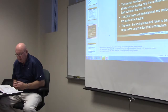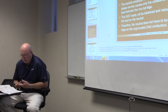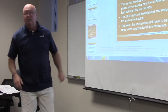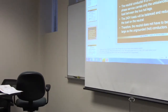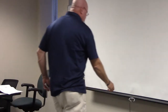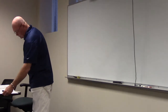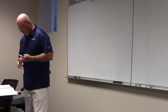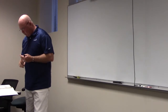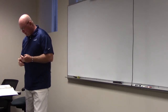Okay. All right. So let's look at a single family dwelling calculation. Example 2.2.2 says that we're given a single family dwelling. Let's look at it together. Matter of fact, I'm gonna turn this off for a second, scroll this up so we can see on the board here. We're looking at the example that he gave us. We've got a 12 kW range, 5.5 kW dryer, 1250 VA dishwasher, three-quarter horsepower disposal, one horsepower pump, one-third horsepower blower, gas furnace. All right. We got 1,624 square feet.